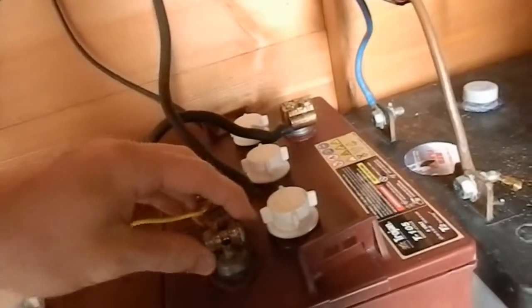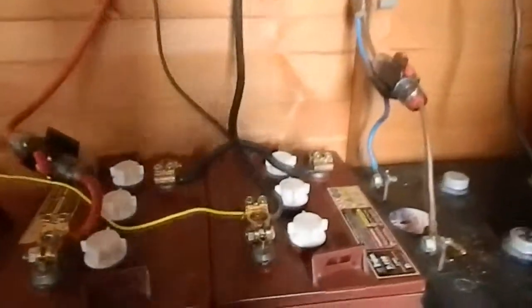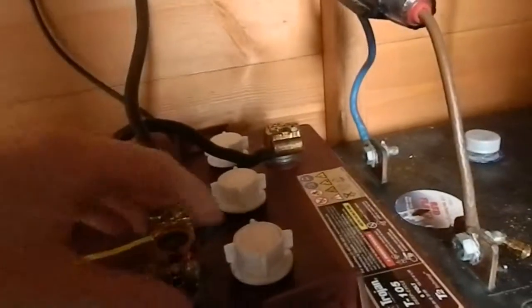Another thing I'll mention is this green wire here. It's actually a ground wire which goes to an earth rod outside. I had to add this because the grid tie inverter sometimes would interfere with the CCTV and cause a loud buzzing, so I put the ground on and that seems to have sorted it out rather nicely. I did try to make them into terminals that you could put a bolt through, but the automotive terminals came in the post, so I just decided to use them.